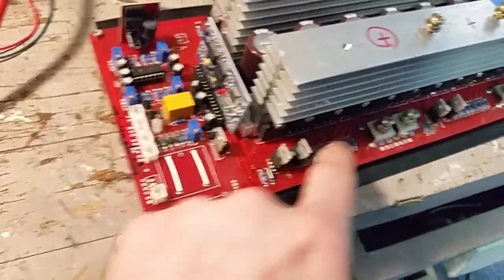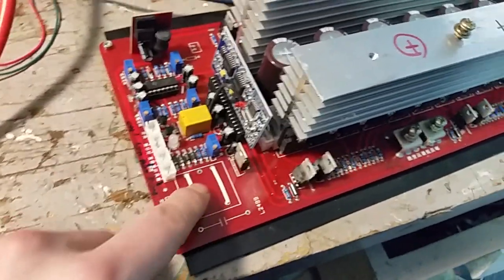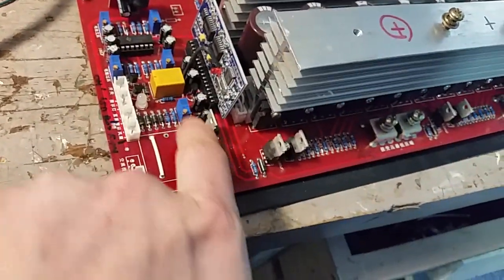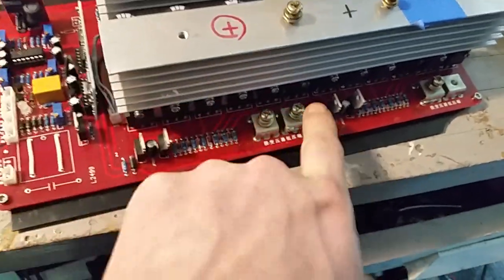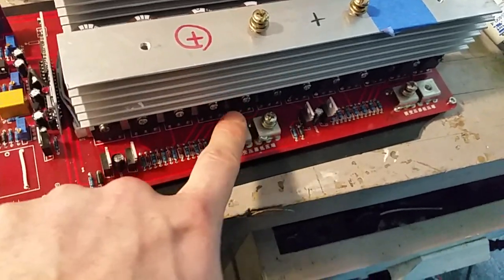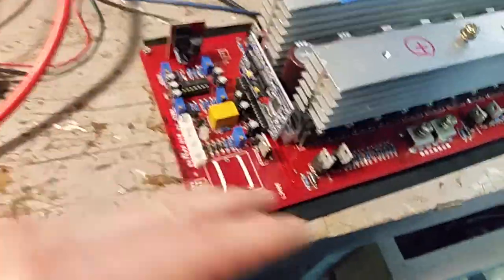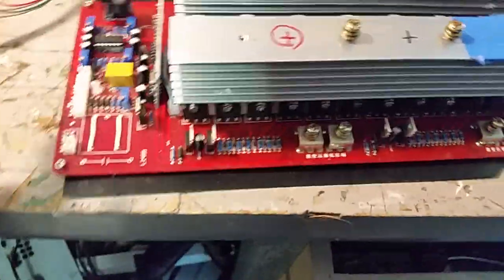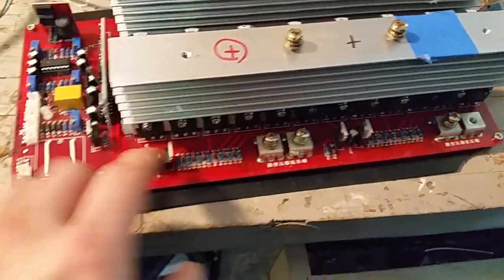I was going to modify this and add a redundant feedback circuit. You get the best feedback when you feed back the 240 or 220 volts on the high side of your transformer through an isolation transformer, bring it down to 12 volts, rectify it, and then use a voltage divider to bring it down to something like 0.3 volts. You can do the same thing with the AC output — just have internal feedback and limit it to whatever voltage your transformer input is. The advantage of having feedback on the output of your transformer is that any sag gets compensated very quickly. But there's still the risk of blowing everything up if feedback is lost. So you can have both with a diode — set this one a little bit lower so if the other gets disconnected, it falls back and outputs a very low voltage. If you get sag on your line, you'll know something is wrong with the feedback circuit.